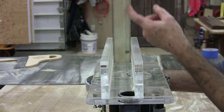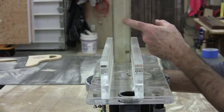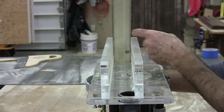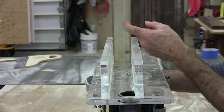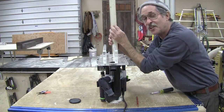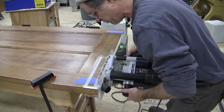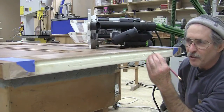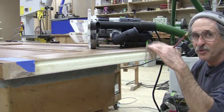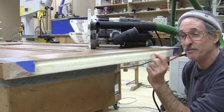Here's my test cut, and it comes right up against the back of the skin on the fiberglass. What I want to do is remove all of the polyurethane foam through here, but on both sides. I'll run the router down this side of the door first, then flip it upside down and run it down the other side — that'll cut two half-inch grooves right alongside the skin. Then I can remove the rest of the foam by hand. I'm going to make that cut deeper, about an inch, so I can put in a good three-quarter to seven-eighths inch thick filler.